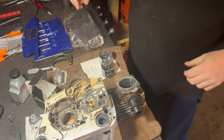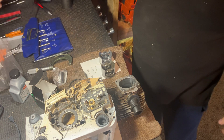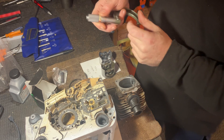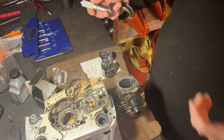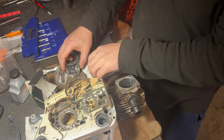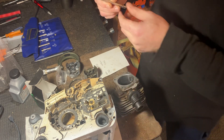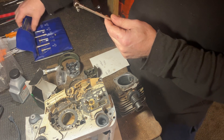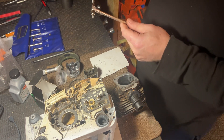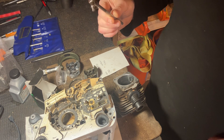I just want to talk real quick — I ended up rechecking my mics. Sometimes you might get some dirt or debris on there. It's going to be a relative measure, but you should always clean up your micrometers if you want to take accurate measurements. So I checked the service manual for this, and then I rechecked it with this gauge here. You can buy these at Harbor Freight. There's only one or two of these you're probably ever going to use for a chainsaw.